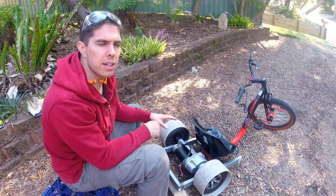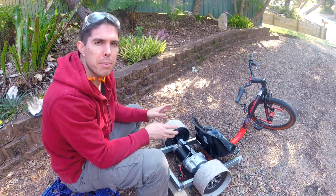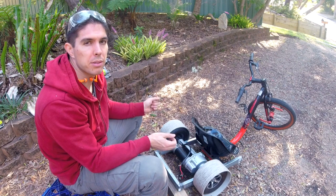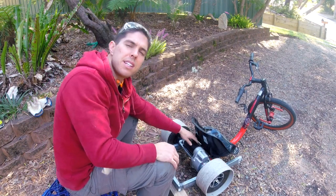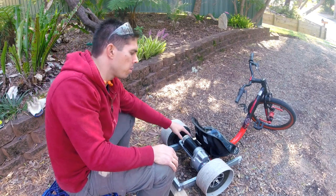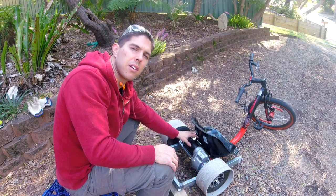What I'm finding is having you sitting just in front of the rear axle seems to be ideal. So I'm just trying to package it as neatly as I can, and then I'll drill the holes and this thing will actually be rolling, which is pretty exciting. One other thing that's going to factor in is the room behind the seat. I might want to move the seat even further back later on, so I don't want to put anything too close to that because it will limit me if I change my mind on where the seat is currently mounted.